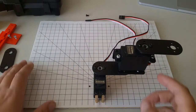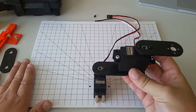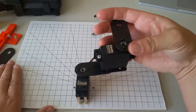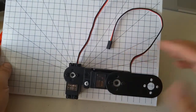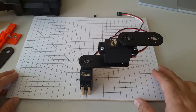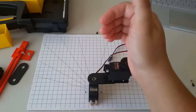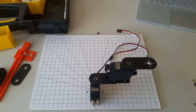Now, our first joint can rotate between 0 and 180 degrees, and our second joint can rotate between -90 and +90. And its 0 position we will define like this. So since this is its 0 position, we know that to draw our kinematic diagram, we'll draw it like this. And right away, before I go draw the diagram, I'm going to make sure I know which direction is positive for the rotations. So the positive direction for the first servo is like this, and the positive direction for the second servo is also like this by the right-hand rule. So let's go draw the kinematic diagram.